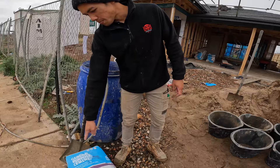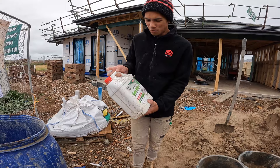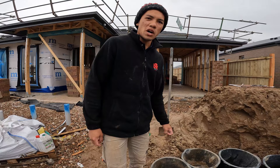So first I'll show you my materials. We've got the General Purpose cement from Cement Australia — GP cement — and our sand, otherwise known as mucadilla brick sand, which is the most common sand we use here in Australia. And some water, and also some lime juice — not the juice you use in cooking, but the liquid variant of hydrated lime.